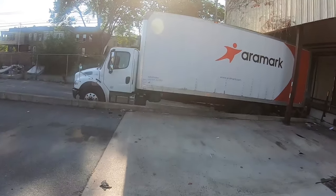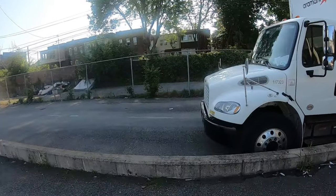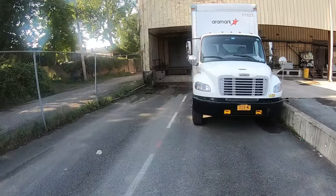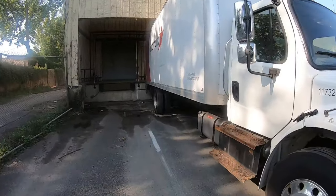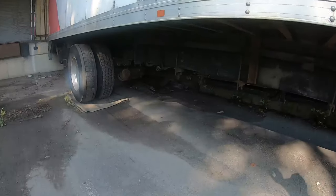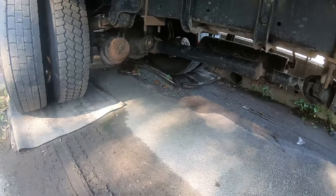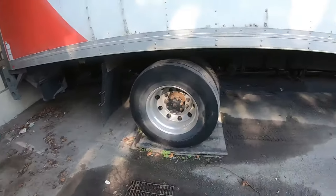This is phase two. We have a tractor trailer loading dock that is this one. And what happens is these trucks sit here overnight in hot heat, and over years it just settles. You see the back tires, how they're down in, and they build it up with crusher run or whatever, and then in the winter this gets water and then they can't get out. So we're gonna concrete apron it. It holds up a lot better.